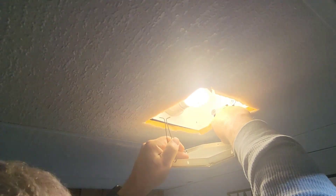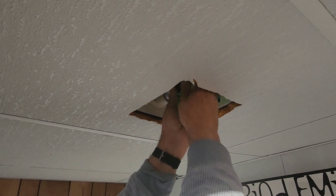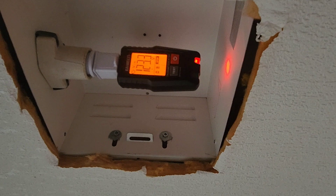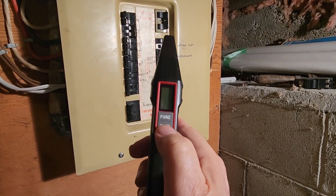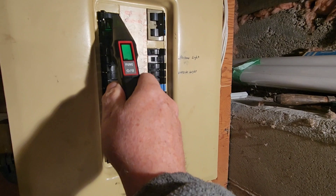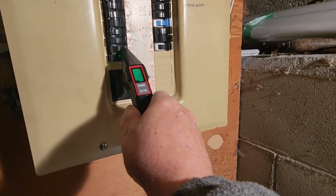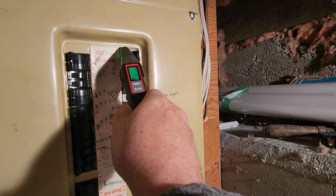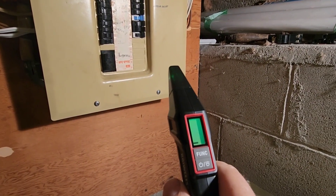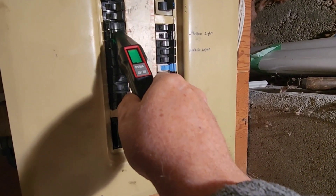Testing on a recessed LED light: remove the cover, take out the light, and insert the adapter plus transmitter. A reading appears — it shows 'open ground.' Now turn on the wand's bottom button, hit the function button so the magnifying glass appears, and scan the whole panel — I think this is a Federal Pioneer panel. Pull the wand away for three seconds: one, two, three. Then re-scan to find the specific breaker.